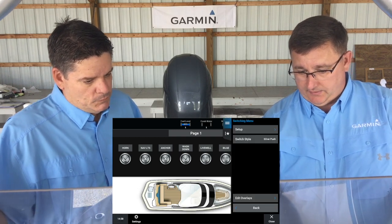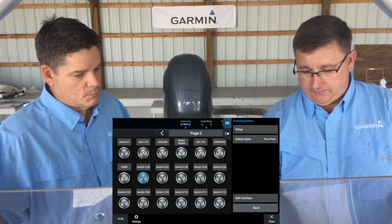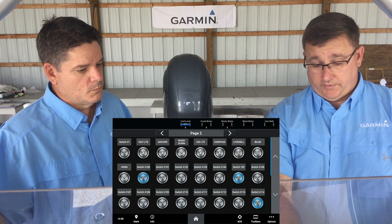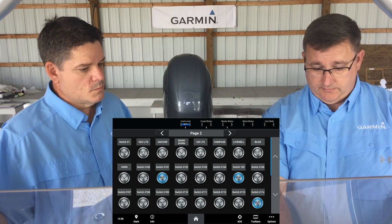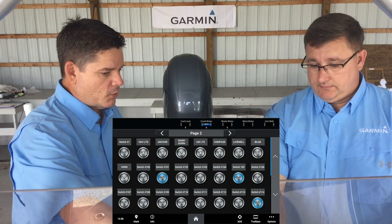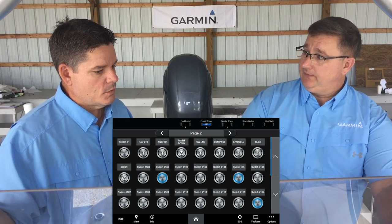Then we'll go into add to another page. We're going to add a page, and you'll notice page two — we have all these different switches. So we have switch 100, switch 101, 102, et cetera. Switch 100 is set for fuel. When I change it to 101, we've changed the resistive tank one to fresh water, and now we have a fresh water indication. In this top bar on our page, you preset one of our data bars — that's correct — so we can show it's shifting as a different tank.